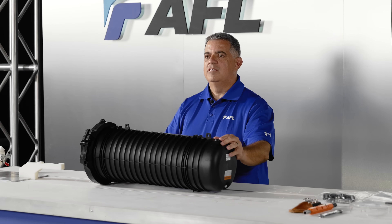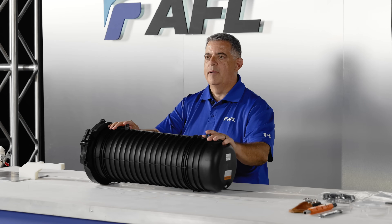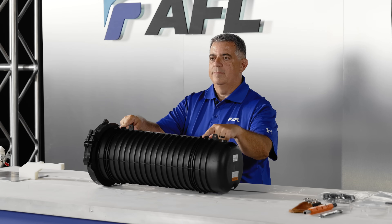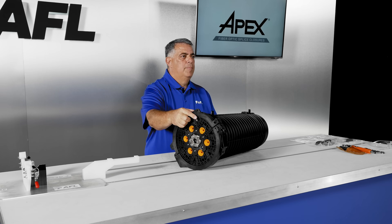This slot is used for pole or wall mount of APEX. The dome tabs can be used when mounting APEX in vaults and pedestals. Aerial mounting locations are provided for AFL aerial brackets or secured with cable spacers and strapping. The pole or wall mount insert can also be used as a reference for aerial installation to show proper basket location when installed at 12 o'clock to the strand.